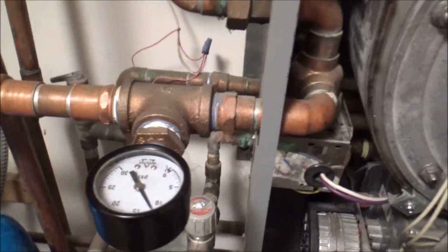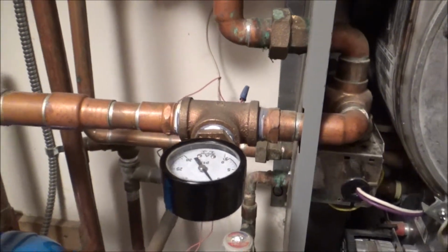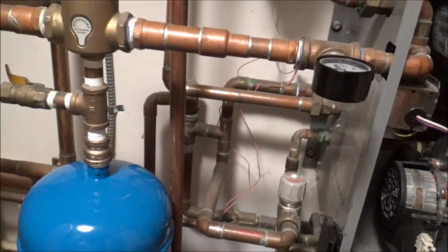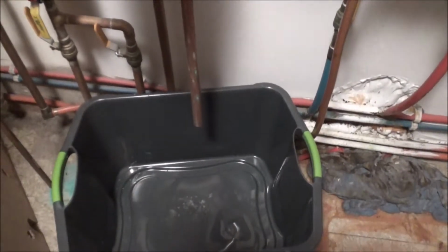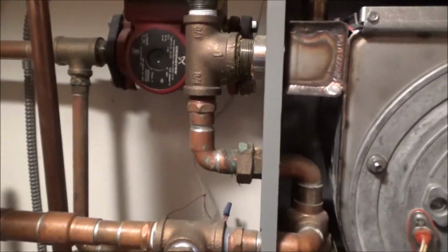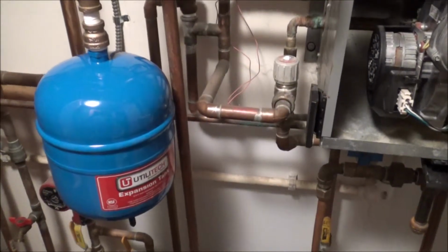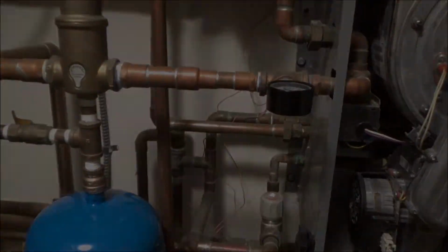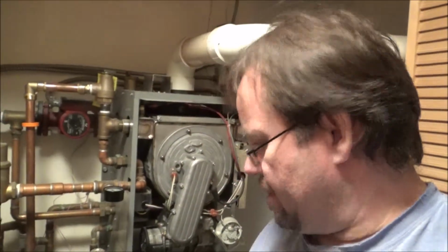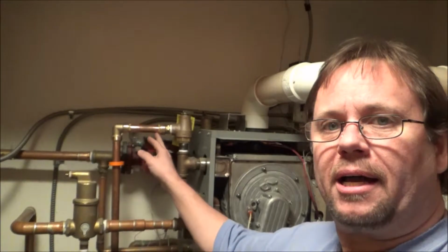See, our pressure built right back up. So nothing running out, but I'm going to leave it going for probably 15 minutes, turn on my heater, and I'll come back and see if it's leaking. Okay, came back in here, and no leaks. So that's a good sign. Nothing in the tote, nothing leaking up along the pipes or anything.